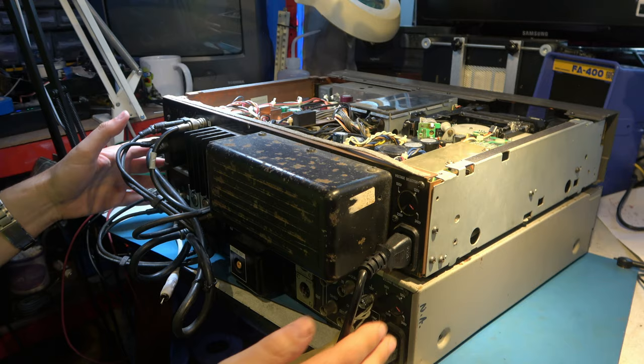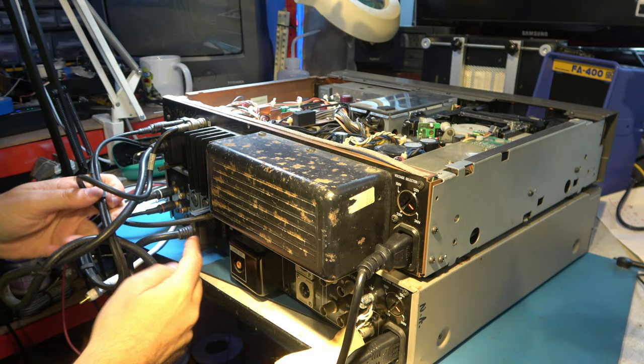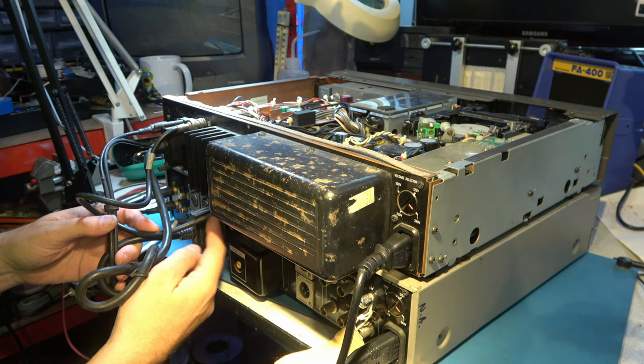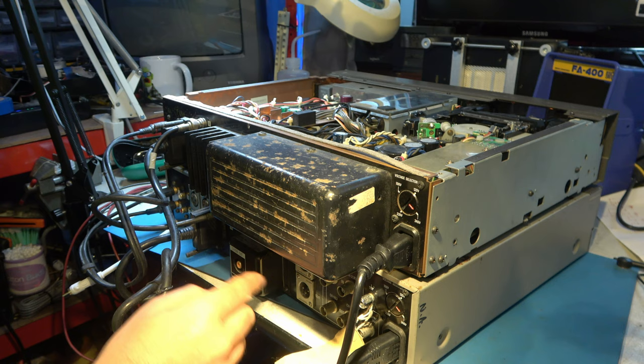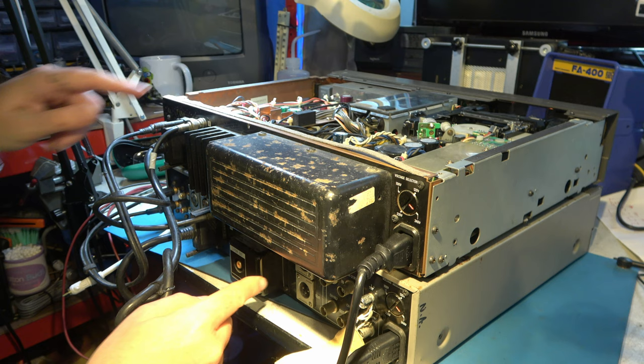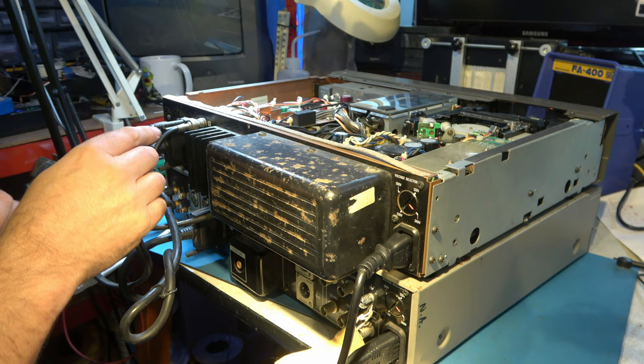And let me tell you, one other blind alley I went up was looking at these connectors at the back here. I saw this connection. You can fight your way through all this rubbish. There's a big multi-way cable here, but there's also a BNC connector between the two halves. And I thought, ah, I better know what's going on here. I thought that is SPDIF out from the interface box at the bottom, feeding SPDIF in here when this has a digital source. I was convinced of that, and I wasted some time looking for signals here. That was futile, because it turns out that that signal actually goes the other way, from here to here.